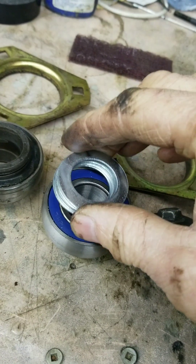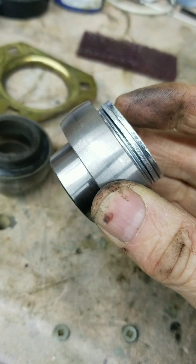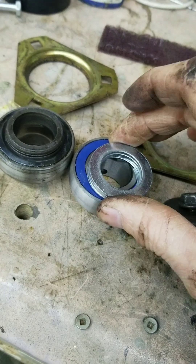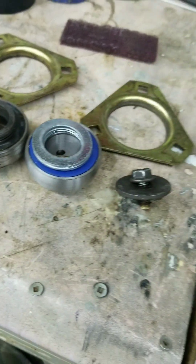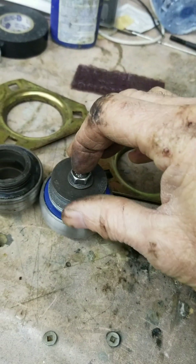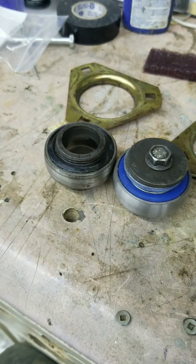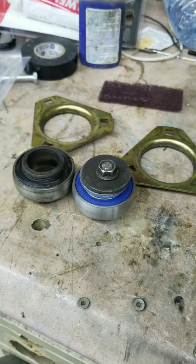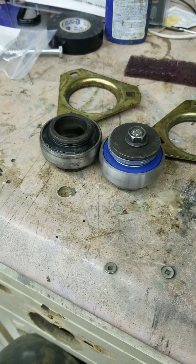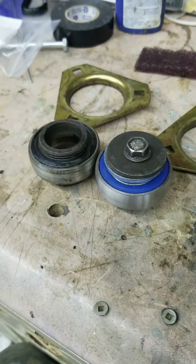At the end of the day what I end up with is this, and it turns out to be exactly the same once I put that stack of washers on. Before I bolt the axle, when I put it in place, these washers will slide over the end of the axle and then the bolt and cap will go on top like so, and I will have the exact same thing I had before with the bearing that's no longer available. I'll put in the comments the part numbers I've used here because this is going to be a very common problem.